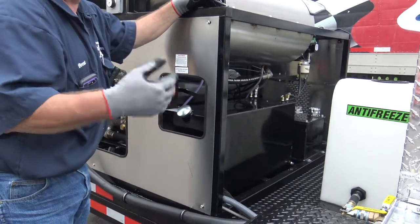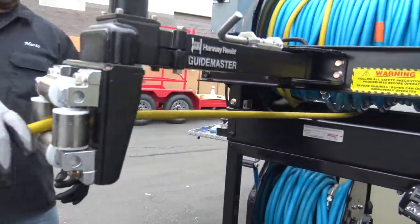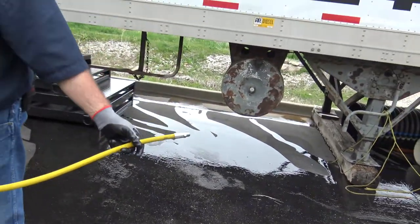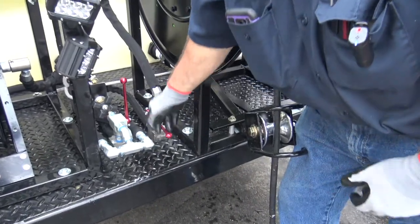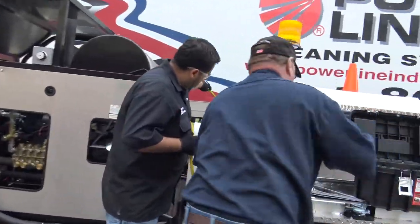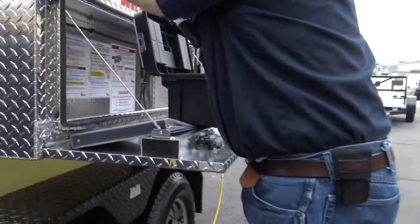We make it here also to different temperatures. To winterize the line, we took the nozzle off so there's no pressure. You have your antifreeze open so it's coming out, have this closed off and this opened up. When you run it, it's going to come out there. When your antifreeze comes out to the end, hurry and shut that one off and do the same to the next one. In the morning when you're ready to fire it up, turn your tank back to regular, fire it up, and it will return your antifreeze back into the tank. When it clears up, pull it away and you've recaptured your antifreeze.